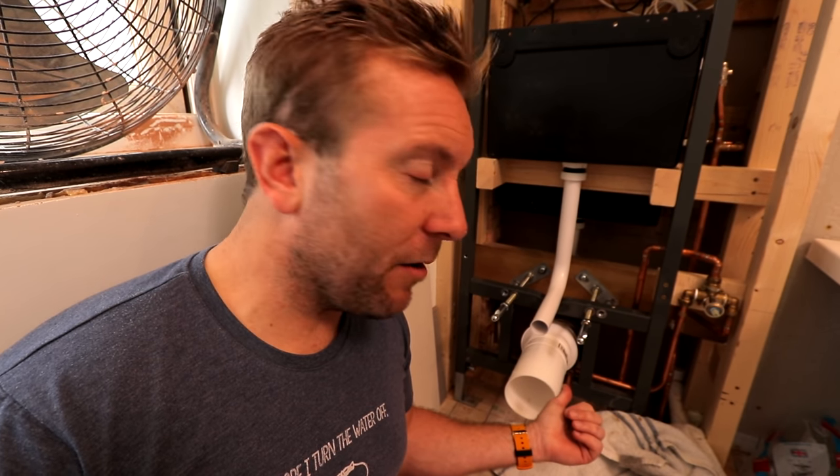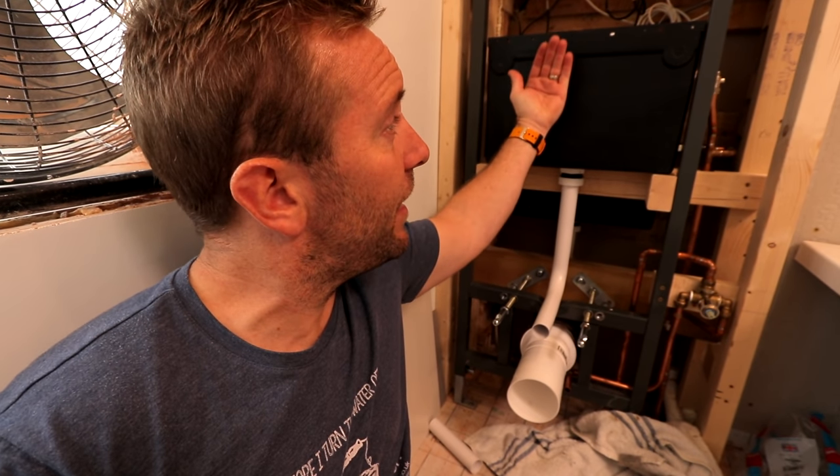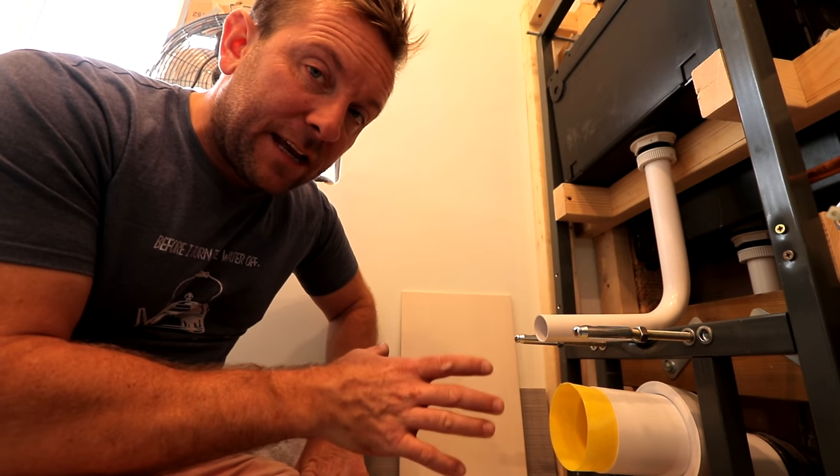I could do that, or I could use a flexible multi-quick. I don't like using flexible multi-quick so much, because number one, I hate accordions, and number two, they get lots of poo stuck in the little ridgy bit. But the thing is it means there's only one joint at each end - and that, to me, is better than having four joints in there all flapping about all over the place that I can't get at. Another thing that's good is that when we do this, we're gonna be able to get to those joints after this is all finished, because I'm gonna have a big door that comes down off this on a hinge. I wasn't able to use a concertina, because the sweep of the concertina wasn't tight enough for us to do that and miss the bottom plate of this metal frame. So I've had to use a small insert, one of those 50 mil offsets, and then another extending piece, and then that extending piece goes into the final multi-quick. It won't leak, but it's just more joints than I'd like - and I'd say to any of you guys out there, if you can have less joints, have less joints.